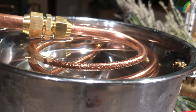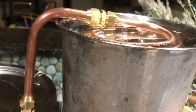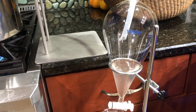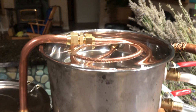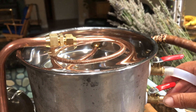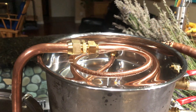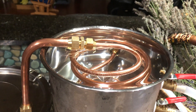It's perfectly normal to see steam rising from the condenser. We're going to want to keep that water level as close to the top as possible so that the copper tubing is exposed to the cold for as long as possible. We'll give the condenser another check — the level is pretty high, so we're going to lower that by adjusting the valves. Those tiny air bubbles on the copper tubing indicate where the gases inside are still so hot that they are generating gas bubbles in the water touching the tubing.